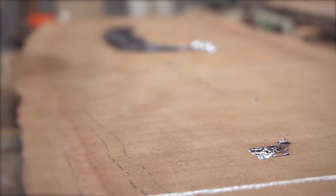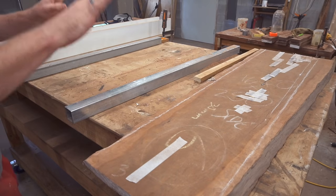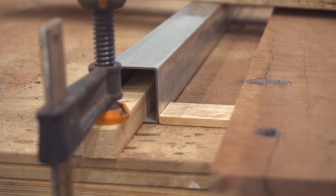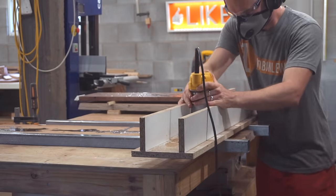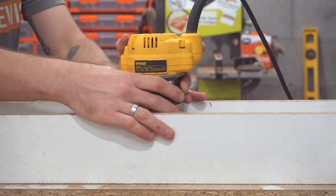When this timber was originally milled it was done pretty well, so it's quite flat as it is. To make sure it's definitely flat I'm going to use a router jig. The sled is just two pieces of steel square stock clamped down to my bench, and I'll take my mill sled and run the router across it back and forth — that will flatten the top.